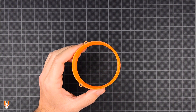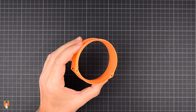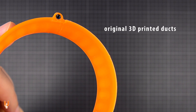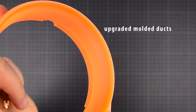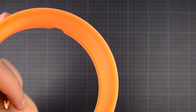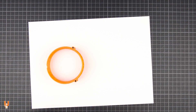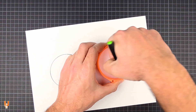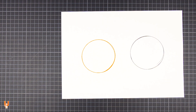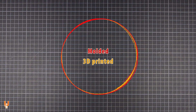In the beginning of the video I mentioned the smoothness of the duct, and this is what surprised me the most, because things did not go as I expected. My Taycan, when it first launched, came with 3D printed ducts. Diatone later made ducts with the same design but using a mold, to make the plastic ducts lighter, more durable and with a much smoother surface finish compared to the 3D printed version. Visually the ducts look the same and basic measurements also seem to confirm this. But 3D printers are not great at making perfect circles — as a result, any tiny little difference in the diameter or shape of the 3D printed duct can potentially alter the performance compared to the seemingly identical molded duct.